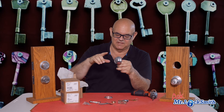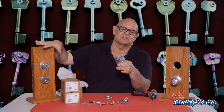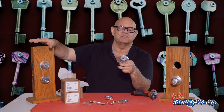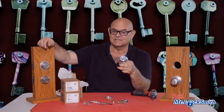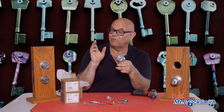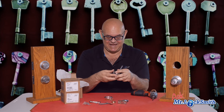The commercial grade versions use what they call the classic keyways — the C keyway or SC-1 — for residential. The commercial versions come with probably over a hundred different types of cylinders, ranging from the classic up to what they call the Everest, and up to the Primus. The Primus is their high security lock rated as pick-resistant. Even the Everest key — the C123 or C129 — is very hard to pick.